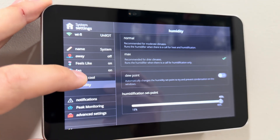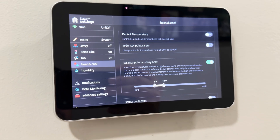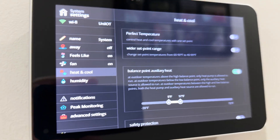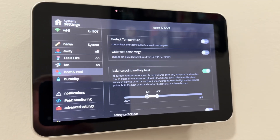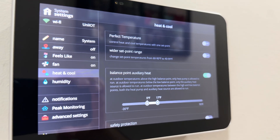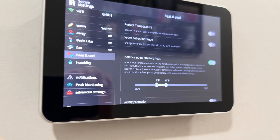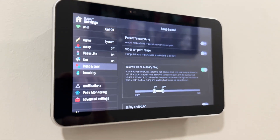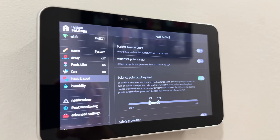We can tell the system how we want the heat pump or the furnace to operate — that's called the balance point. The balance point means at what outdoor temperature we want the system to heat with the heat pump versus the furnace. In this case, we have it set at 5 to 17 degrees: when the temperature outside is 17 degrees or higher, the heat pump is responsible for heating the house. Between 5 and 17 degrees, the system tries to use the heat pump, but if it can't keep up because it's too cold, it'll switch to the gas furnace. Under 5 degrees, only the furnace heats the house. This particular Samsung heat pump is capable of producing efficient heat down to minus 13 degrees.